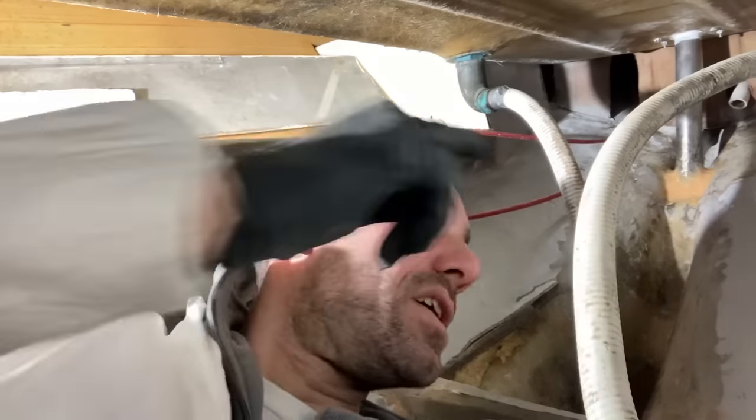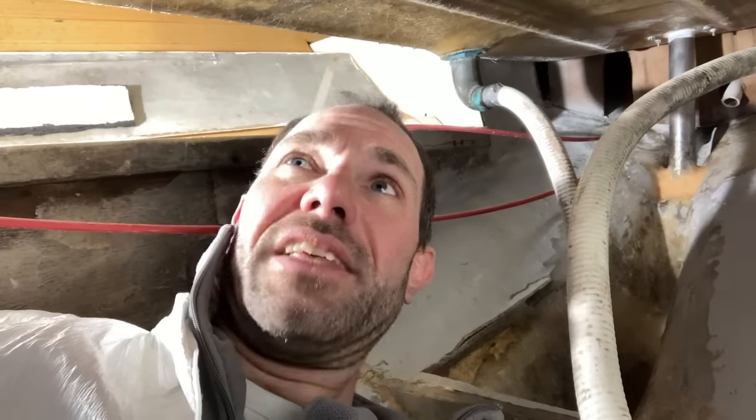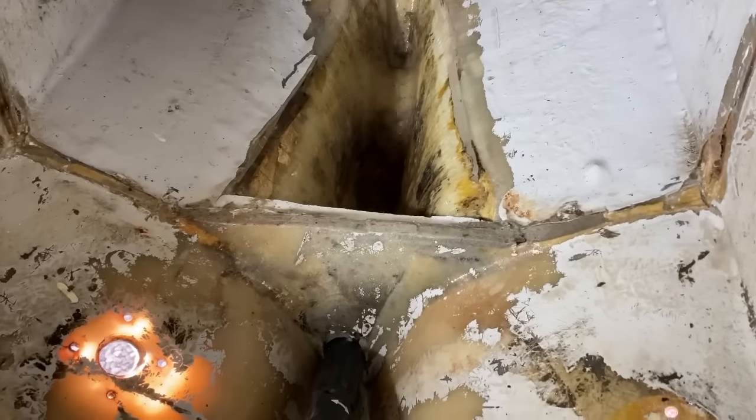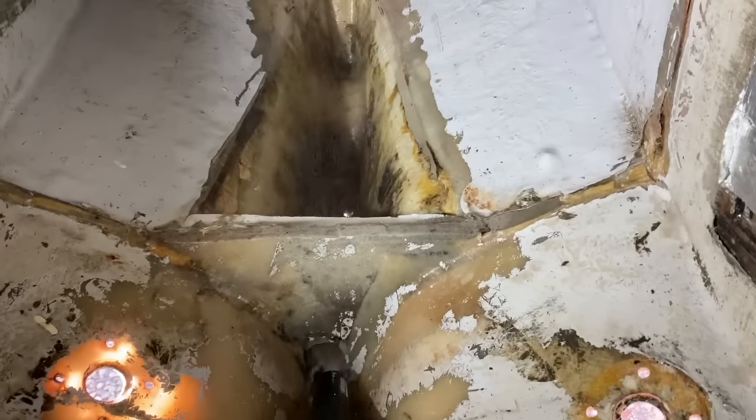Before I was doing the rudder tube I was cleaning in here mostly. I put a load of cleaning chemicals down in the bottom of the void back there, so sort of engine degreaser and general cleaner, and then I also had a bit more of a scrub around here today because there's a few blobs of grease still kicking around, and then with my pressure washer the whole engine bay got pressure washed, which sent a bit of spray around the boat, but most of it ends up in the bilge or going out the stern tube.